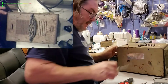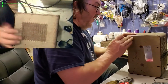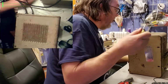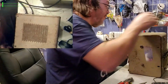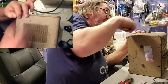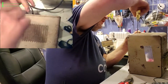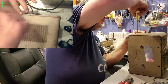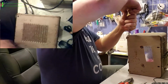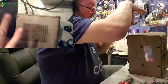Alright. I will get these both caught before I tighten these two up. I'll do the same over there. Otherwise what happens is the top part, especially if it's sheet metal, will not be completely free of the hole, and it'll bind as you try to screw it in and actually tries to make new threads in the edge of this sheet steel. That's not good. It kind of makes it hard to go, and the screw gets kind of bummed up.